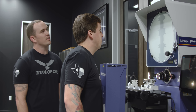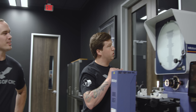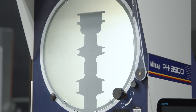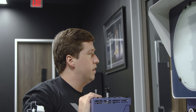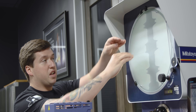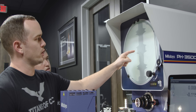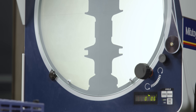Wow — this is what you couldn't achieve without the right tools. Little features like this one in here: if you don't have a tool small enough you can't get in there. The fact that I can just plunge down and form all these features in one movement is wildly simpler than coming in and doing all these individual contours. Checking this third groove — it's supposed to be 0.115 but it's about 0.116, because it's actually an intersection point of two groove tools. If it's a thou off, that's a real adjustment, not the form tool itself. What's impressive is there's no visible blend line on this diameter where the two tools meet — that's a really good-looking part and a really good result.